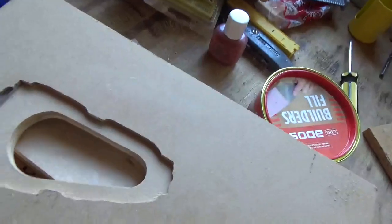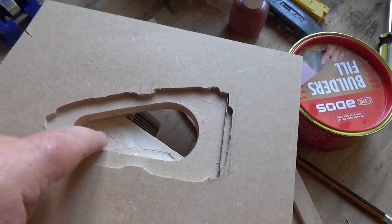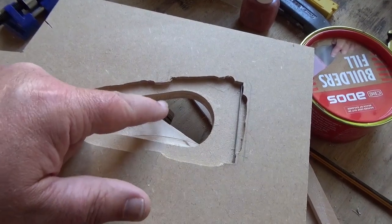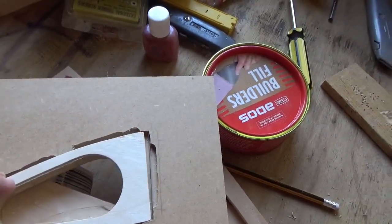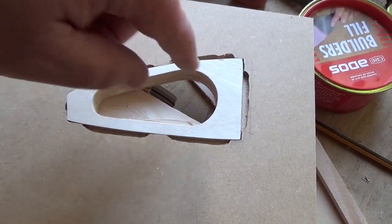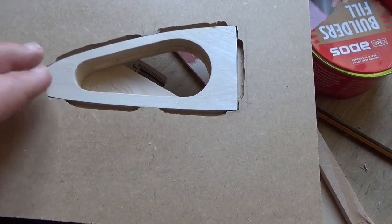So you can see here there's a hole cut all the way through. I cut the hole all the way through, measured it out, joined the two together using a scroll saw, and then sanded it to get the right depth. In particular I needed a quarter inch between that facing and the edge, and once I felt I had that I could put the entire sheet in — without the hole at this stage. I could drill a hole in here between the two screw holes, just big enough to get the router through, and then just go all the way around the inside. Job done.